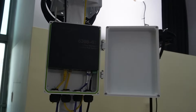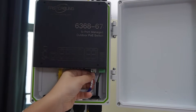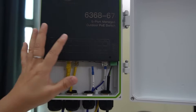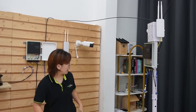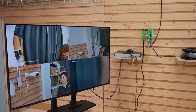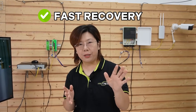So let's see it in action. I'm going to unplug the fiber optic cable on our outdoor switch number three. Normally in a daisy chain setup, this would disconnect everything beyond this switch. But watch what happens — you can see all our cameras are still working fine. That's because the traffic smoothly reroutes through the other side of the ring. This is the power of ERPS: fast recovery and seamless redundancy.